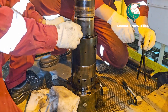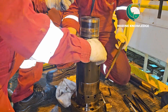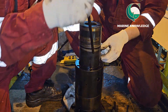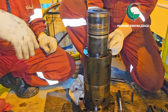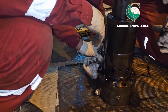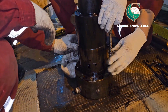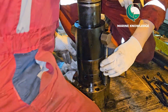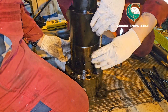Always, as I say, use a proper Allen key while you are removing it, because sometimes if you use the wrong Allen key it may damage the head of the Allen bolt, and next time whoever does the maintenance they may face a problem fixing the tool to open the bolt. Now we are opening the bolts. After opening the bolts, keep them separately and safely. Next, you need to disconnect the top cover with the barrel. This is the jacking tool we use — it is a special tool provided for that particular fuel pump.